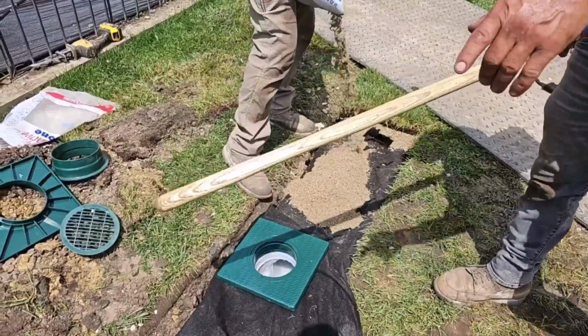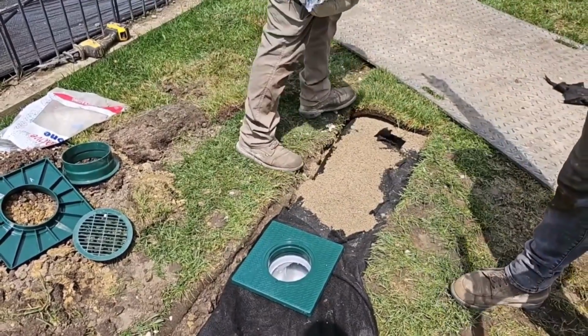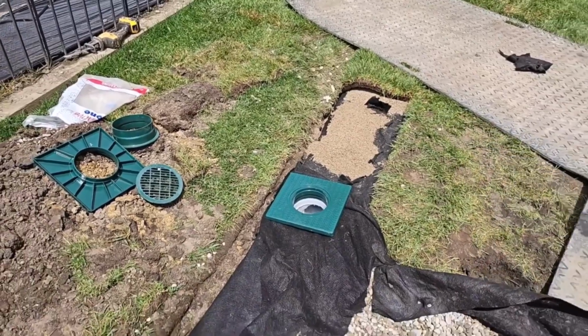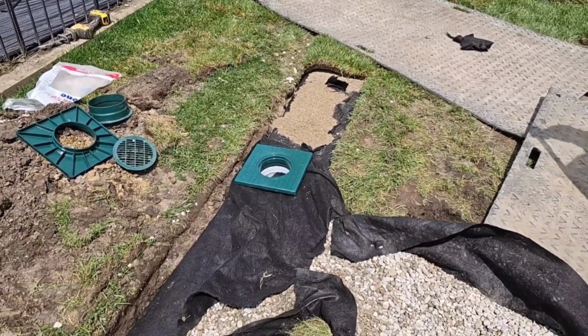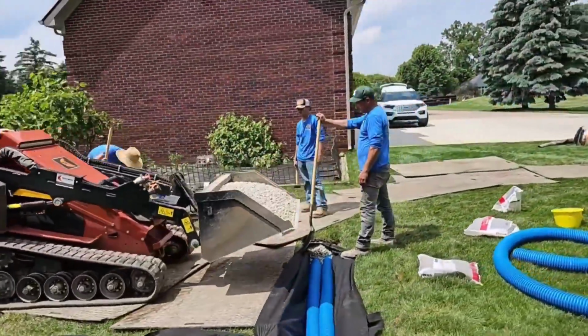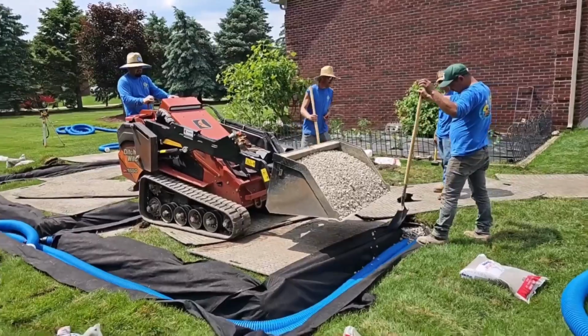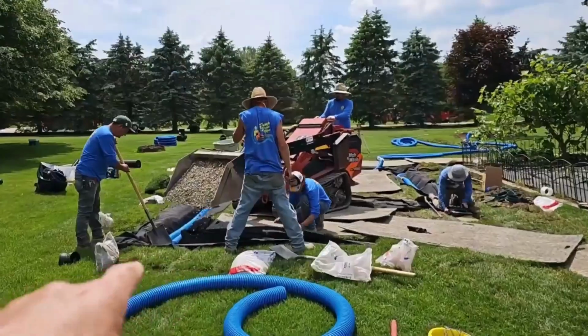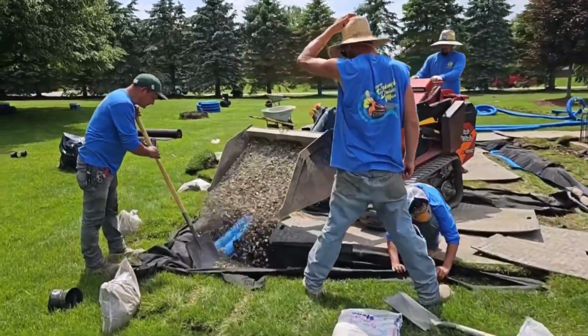Yeah. Like 2 pipes, because I start over there shallow because over here is more high. Oh, I seen it, dude. You're deep over here, which is good. I dig shallow to pitch this. The magic ingredient is the width. When you take it to 2 pipes wide, they work spectacular. Shallow 2 pipe system right here.